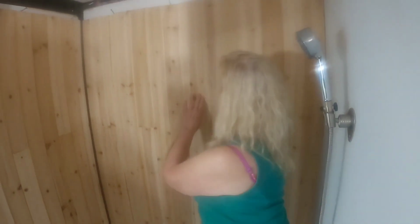This is the cedar planks. Now, these are quarter inch thick cedar planks, tongue and groove. They're about 3.5 inches wide. And what we did when we put this up there, you saw where we had the stringers yesterday, where we laid out the grid with the stringers. We made sure that each plank was glued quite well to each stringer. And in addition to that, we also filled the groove with glue as well, didn't we, dear? Yeah, that ought to be pretty well sealed. It is pretty well sealed.